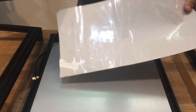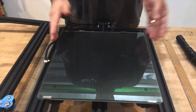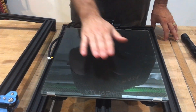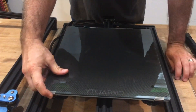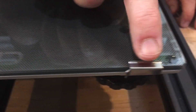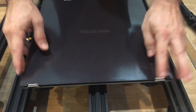I don't have the silicone on hand, so I'm going to show the other way of mounting. We can mount the glass plate onto the machine upside down — we will clean it before putting on the magnet. We have the issue of these bed clips sticking up, so I cut out the magnetic base around them. I need to rest the magnet beside the clips to make sure they do not stick above the magnet. In the case of the Creality machines, the little tab on the front was sticking up too high, so I actually ground these down a little bit with a grinder or Dremel tool so they're not higher than the one millimeter magnet.